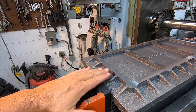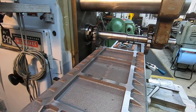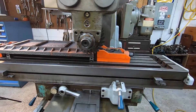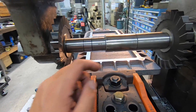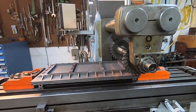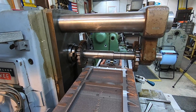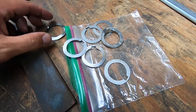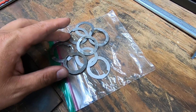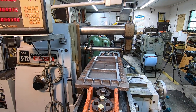When you've got a toe clamp holding something down, you don't really have much to worry about as far as lift. But in the vise, you do have to worry about lift. So even though we're only taking a small amount on each side, I didn't want to risk pulling that up out of the vise. We're going to try our climb mill and hopefully the machine handles it okay. We're going to be taking approximately an eighth of an inch off each side. I've actually got to go in there and install another shim because we're about 5 thousandths shy. So I'm going to keep shimming — I've got a little bag of shims of all different thicknesses. Very handy to have when you're trying to set up two cutters to have an exact spacing. We'll get that adjusted right and we'll be ready to start making some cuts.